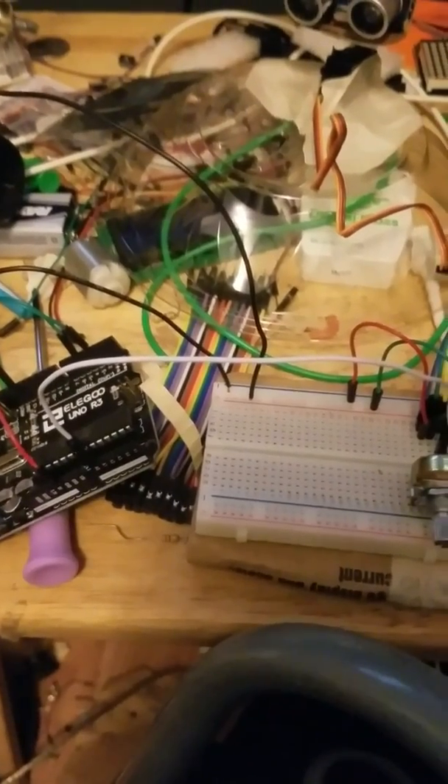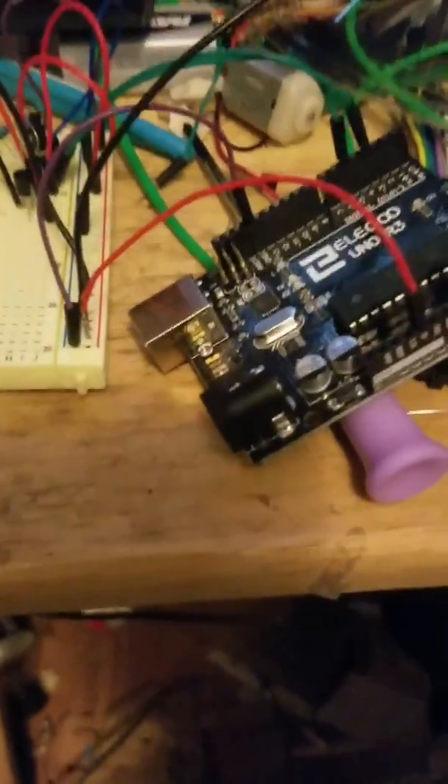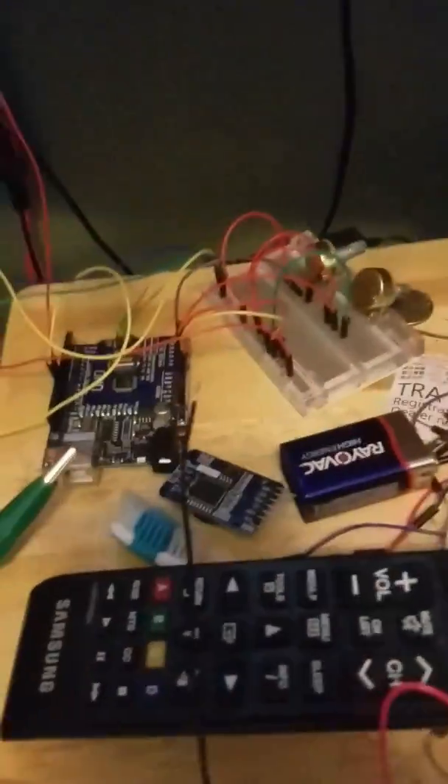One will be the master, the other will be the slave. It shouldn't be that hard. Then I can multiplex all of the information and address it with easy Arduino libraries, then demultiplex it and reassign that information to output pins. So I can have input pins and analog values from joysticks on those input pins — that will send what pin it's coming in from and what potentiometer value it is — and then it will receive as though the potentiometer is hooked directly to it.